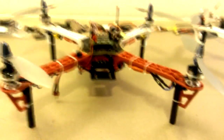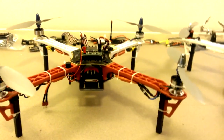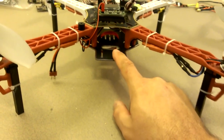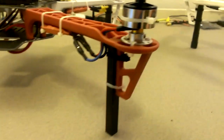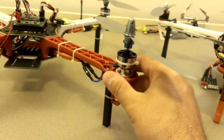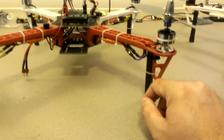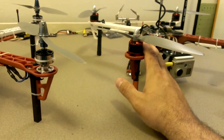I did the maiden flight today and it flew okay for a maiden flight. I'm going to attach that video here at the end. But real quick, I wanted to talk about the frame differences I've noticed. The size and all that is identical. The power distribution board in the bottom is very similar to the DJI, although I think the DJI is a little higher quality. The arms on this knockoff are really, really crappy compared to the DJI arms. If you look real close, you can see how thin this is right here compared to the DJI arm. It's got a lot more wiggle side to side compared to the DJI. The DJI does have some wiggle as well — it's not a real stiff frame — but this one is much, much worse. The cost difference between the two frames: this one's about $20, and this one's about $40. I'd recommend probably going with a DJI frame.